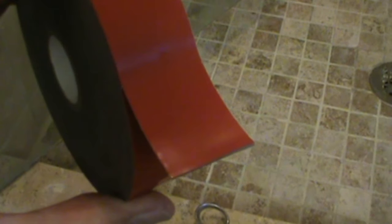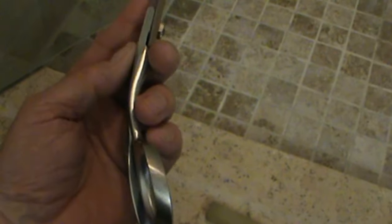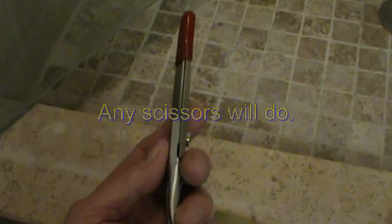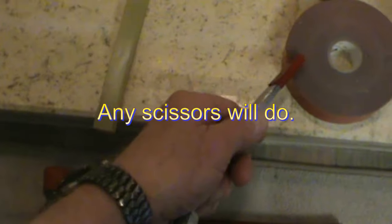This is how the roll comes — just a big roll. It's gray, actually. When you skin this little red vinyl coat off of there, it's gray on both sides. What I did was put it on the urethane rubber — you can see how it overhangs a bit. You line one edge up perfectly, and then I used carpet shears — though you don't need those — and just come along and trim the excess double-face tape off.